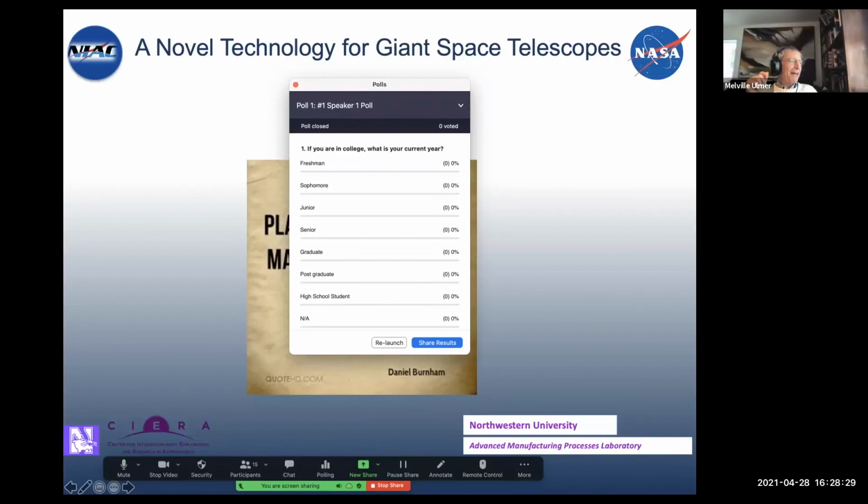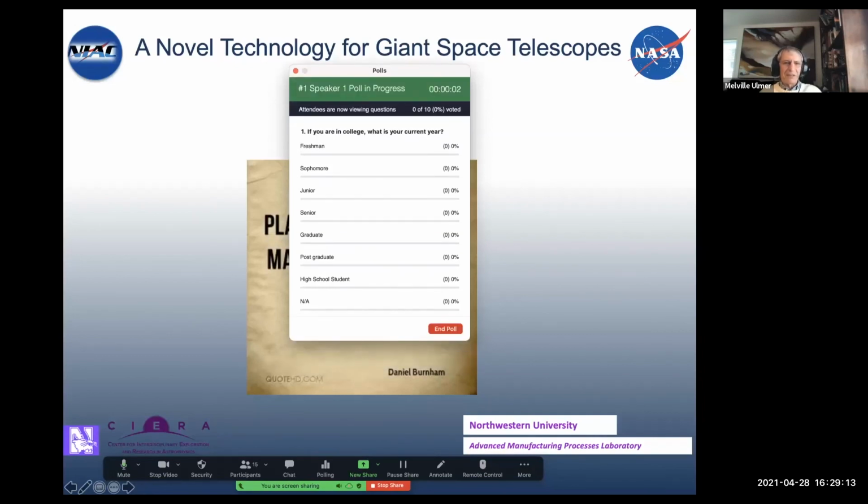I hope it is. But seriously, nothing is put together that tightly that you would get vacuum welding or cold welding. I don't know. I've worked on a mission where we had a moving part in space, all right, vacuum. It tilted off and on where it was pointed every 2 minutes for 10 years. Okay, so cold welding is, we break out into a sweat about lots of things, but cold welding is not very high on the list.